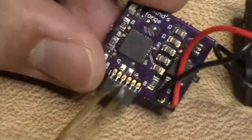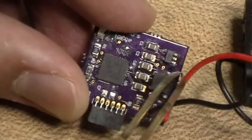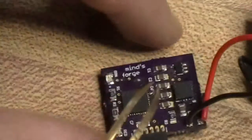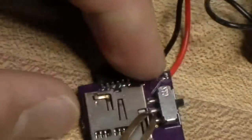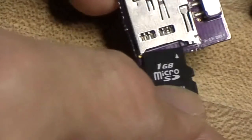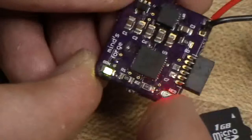And this is the final one that's working right now. We have the programming header here, the CPU here, a low-dropout voltage regulator at 3 volts, and the accelerometer — QFN chips. On the back side we have the power switch and the microSD card slot; the card just slips in. And two LEDs: a red LED and a green LED.